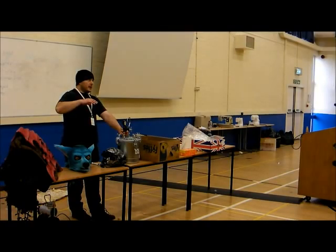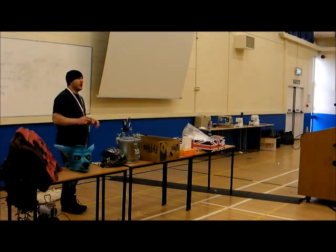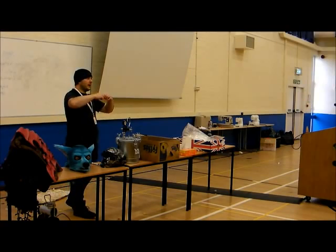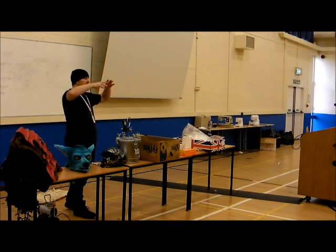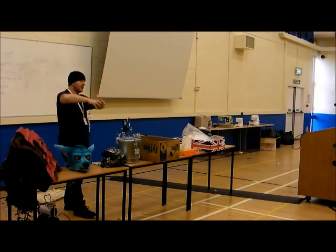Resin is thicker than water and thicker than air, but air will be trapped in it. However, if you subject it to pressure, it will crush, and the air will go, "Don't want to be here anymore, I want out," and it will escape. If you look at that mould, it'll escape through the little air pockets. And you put a little reservoir of resin in the top and the resin gets sucked in.